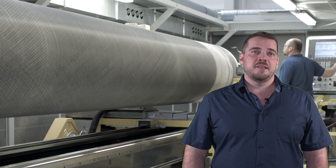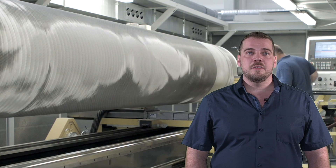After this processing step, the roll can be picked up properly in the machining center for grinding. The surface will be ground to the right size and get the ideal condition for coating. We are able to achieve concentricity up to 0.03 mm — and just to get an idea, this is half the size of an average human hair.